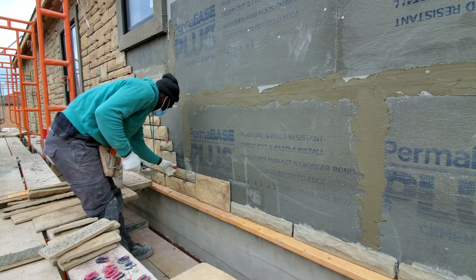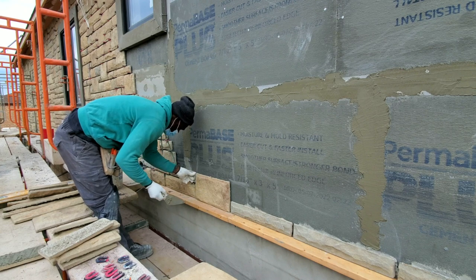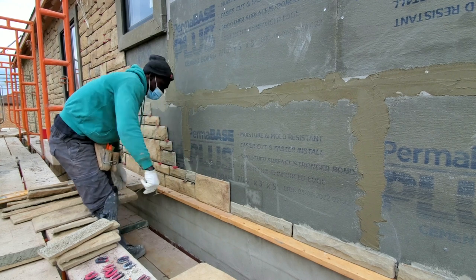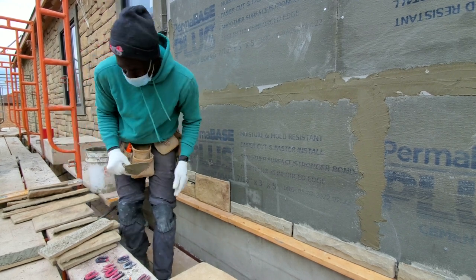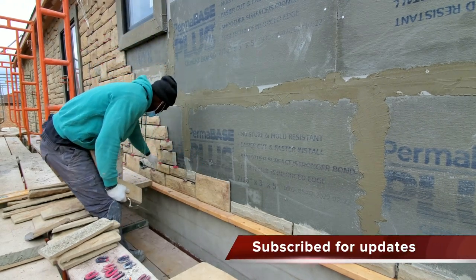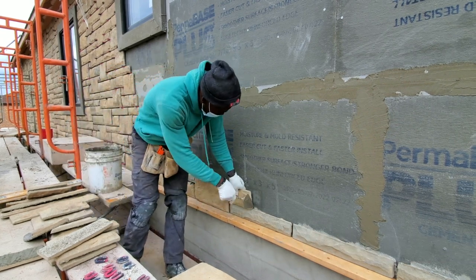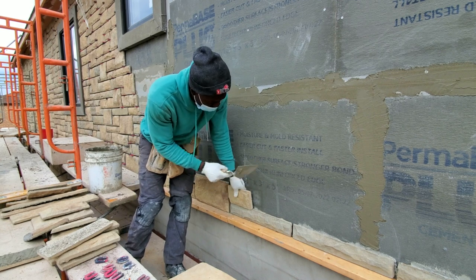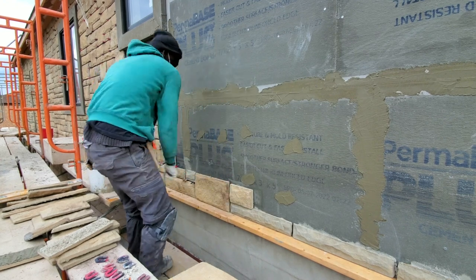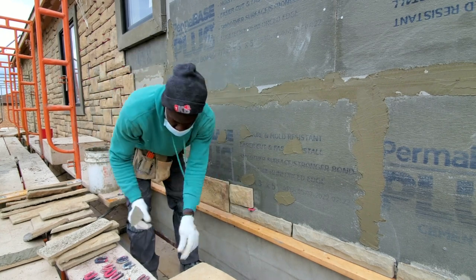This one is placed right underneath — some of the stone is higher — so you might have to put two red and one black spacer in some cases just to balance the joints. This line here is already around three feet, so we want to put a stone right here, then put a different size right in front so that we can break the band. Squeeze them on nicely and get our spacer right here, just like so.